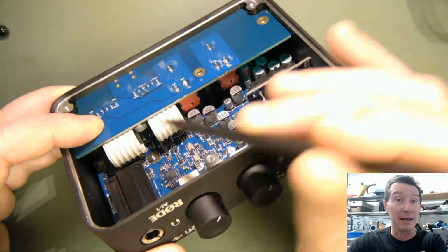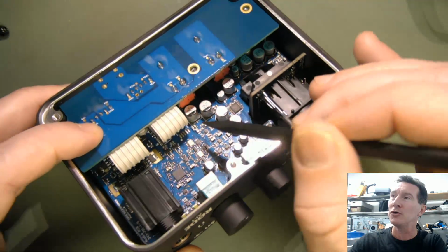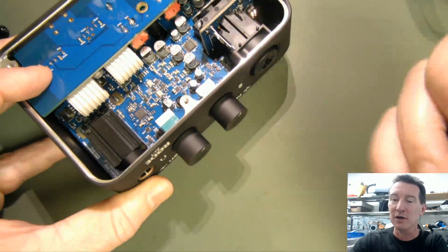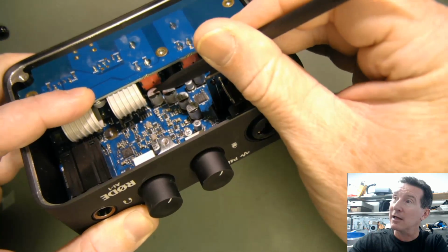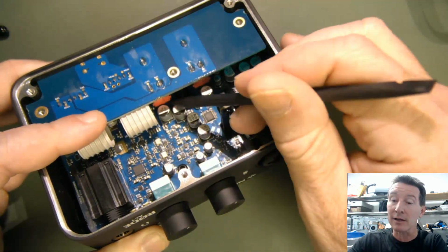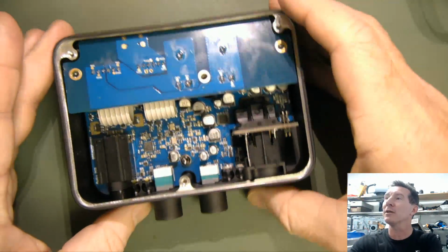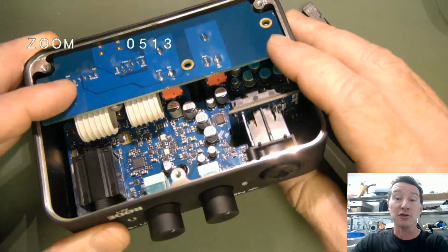So doing a 3D model for every single component would be very beneficial to them. Then you could import not only the main board down here, but this board with the 3D models of the ribbon cable, all these connectors and these plastics and everything else, and you could do the knobs too. And you could see at the design stage that that capacitor is not going to foul with that. You can be 100% confident it's going to work, because the software will just flag it and say these two components are touching. When you insert the board in software, it knows that they're going to foul. It really is a very valuable tool, and can save a lot of respins, and get it right the first time.